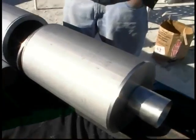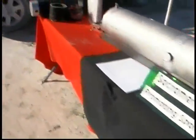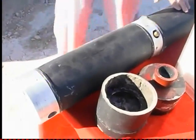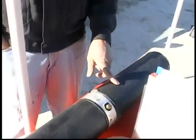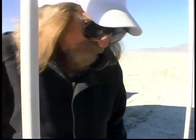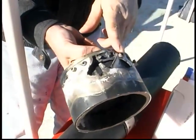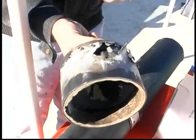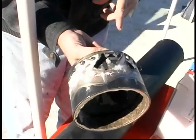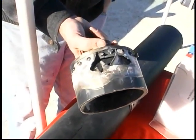This is a really interesting motor. I'd love to see it fire on video sometime — and I see that you did fire one down here. Tell us the results. This is my first attempt; it produced 140 pounds of thrust for ten and a half seconds. There was a breach in the rocket motor when it was initially fired, but it still held together. The specific impulse of the motor was 160 — even with a huge hole in the combustion chamber.